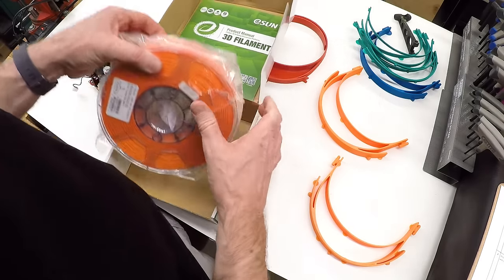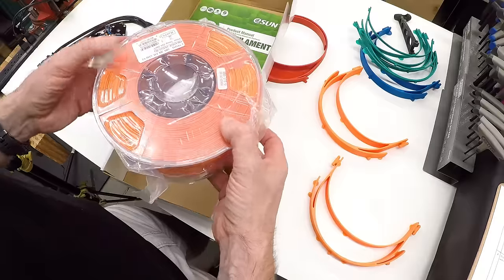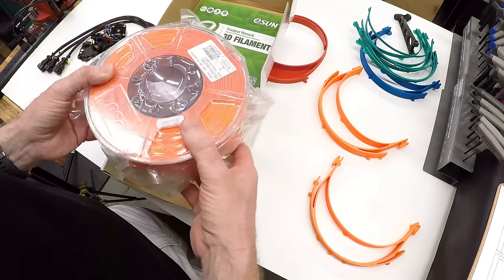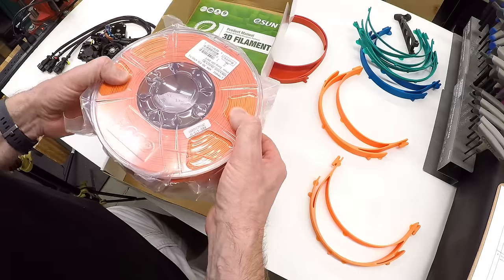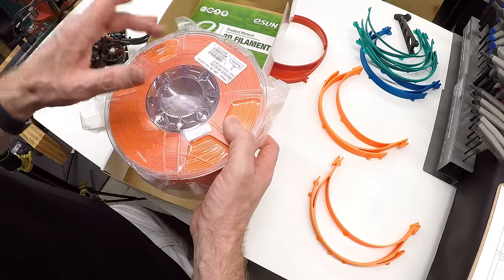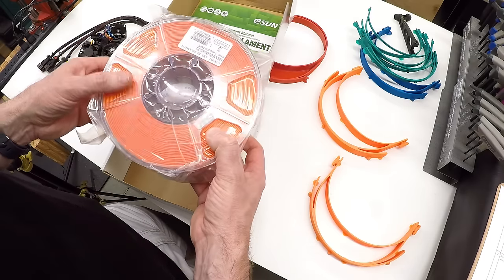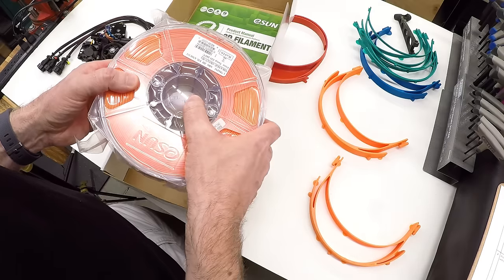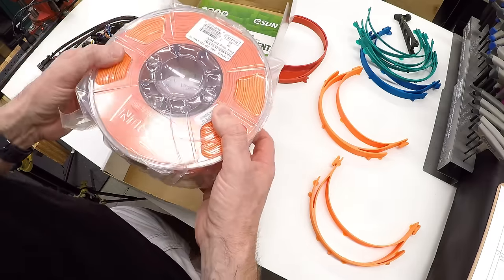So what is ABS? ABS is actually a combination of three different plastics: acrylonitrile, butadiene, and styrene. Because it is a mix of three different materials, the formulations are going to vary. If you print a lot of ABS, especially from different manufacturers, you'll find some smells stronger than others, some maintains its color better when heated and cooled, some ends up glossy, some more matte, some shrinks more than others. The properties can vary quite a bit — more than you'll see with PLA and PETG, which are not combinations of different plastics. Because ABS is a mix, the proportions and chemical composition can vary a little bit.